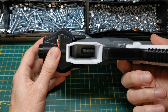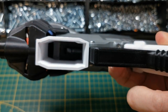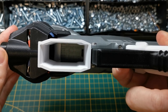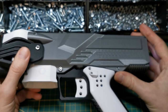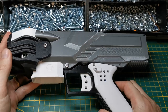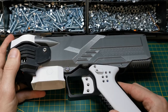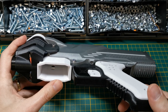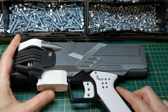If we go ahead and fire this, you can see the dart pusher internally. Internally there's a geared motor with metal gears. This was the trickiest part in the beginning — finding a decent geared motor. The common TT motors with plastic gears wouldn't suffice, so it took a while to source one with metal gears. These metal gears will not wear out very quickly.